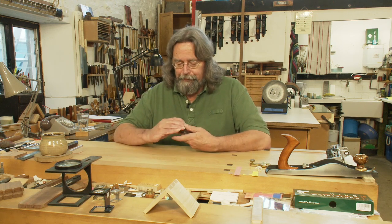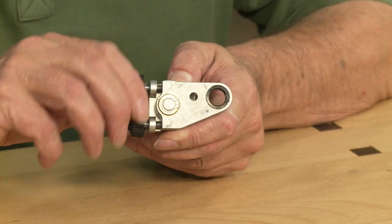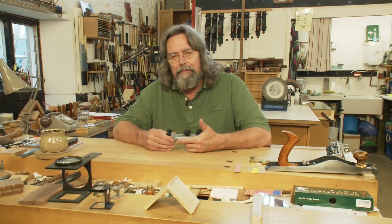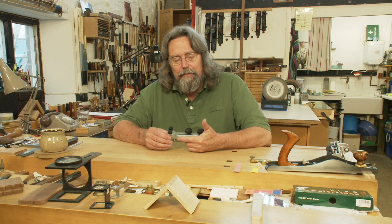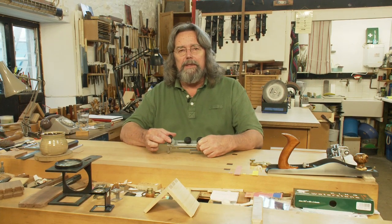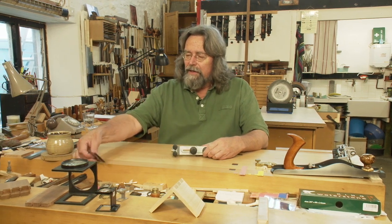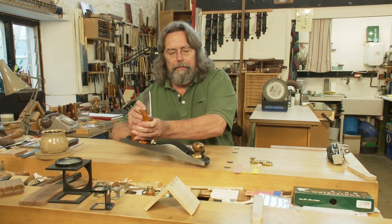What I've discovered is that if I release these knobs by half a turn each I can get a small camber which suits my bench plane, tuned up as a super smoother. If I undo them both by one turn it suits my block plane blade. And finally, perhaps most useful of all, if I release them by two turns I can create a suitable camber for this bevel up jack plane.